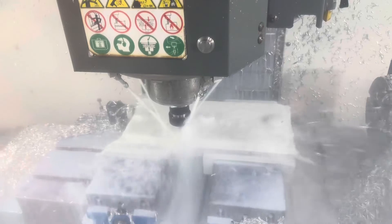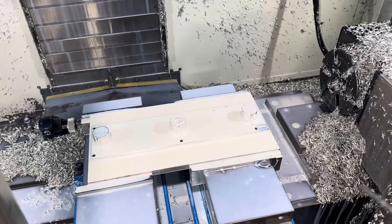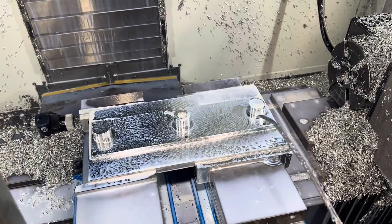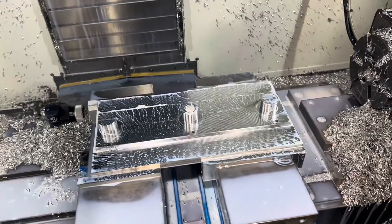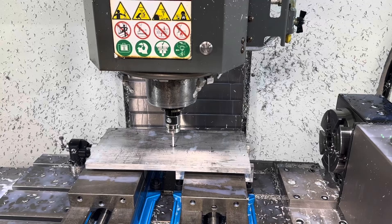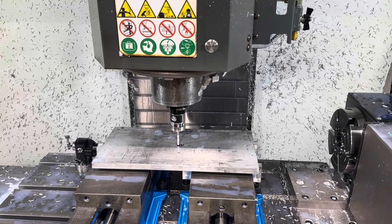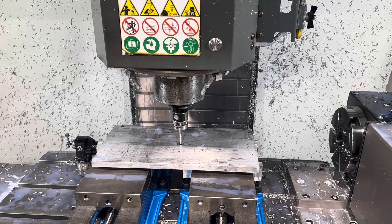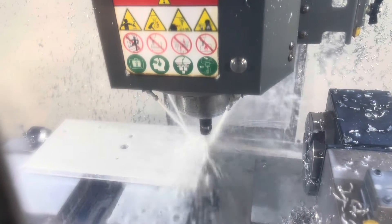Because the fitment of the fixture into the valve cover for the second operation is pretty important, I wanted to machine the fixture first so that after machining the top of the valve cover, I can double check the fitment of the fixture without taking the valve cover out. That way if the mounting was too tight, I could go back in and open up those holes and double check again — all without taking the valve cover out of the machine and possibly losing its original position.